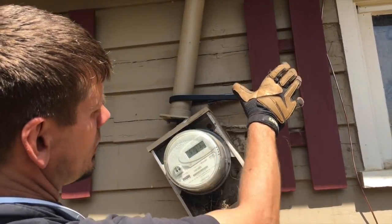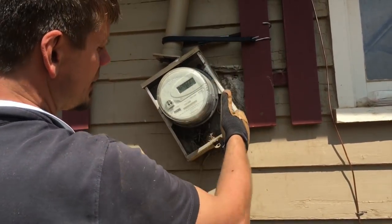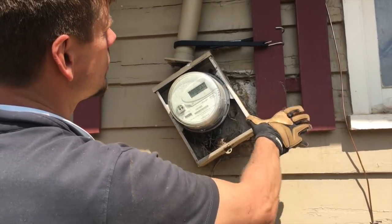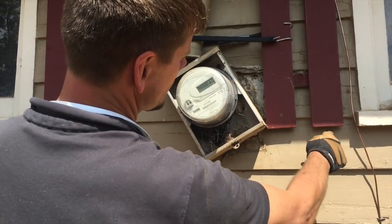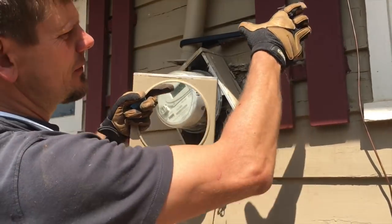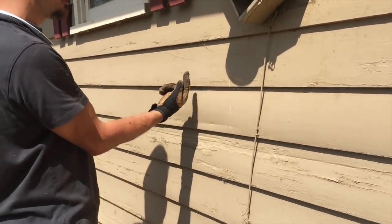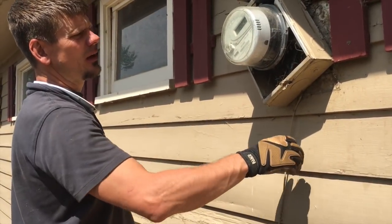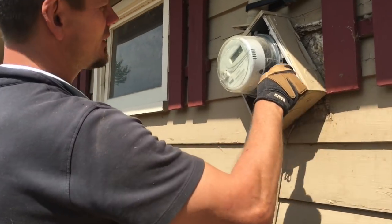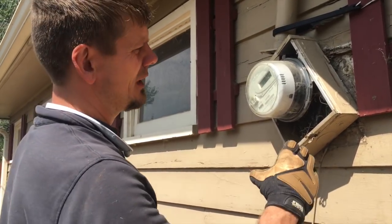What we're going to have to do here is a side-by-side — an all-in-one with a meter, a disconnect, and four to eight breaker slots. The problem is you can't punch out on the left side, so we'll most likely have to scoot over 14 inches inside that panel, use that nipple, and drill it out to the right side of the all-in-one. From the bottom of the panel we'll probably do an LB to an LB coming up into the bottom of this panel, and now I'll have a main 125 amp breaker disconnect over here with the number two aluminum.